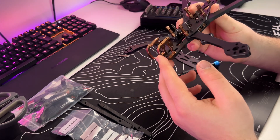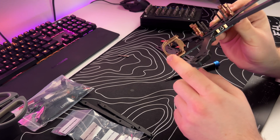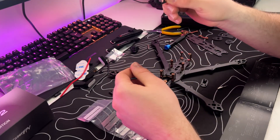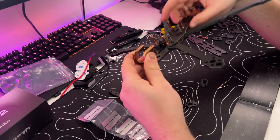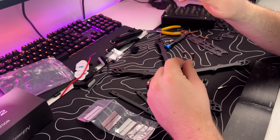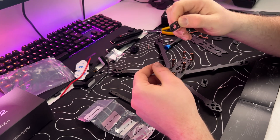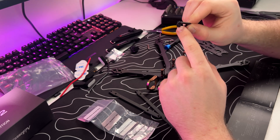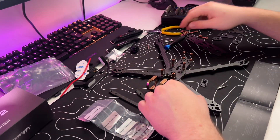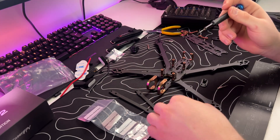Now we attach the metal hardware. Watch out for your two screws right here — they are not exactly in the middle, so they will be a little bit on the top. Watch out when you screw your camera mount on top. Now we can start attaching the camera plate — put them through these two holes on the front. You have two options: a smaller space for a smaller camera, or if you have an O3 air unit you can use the bigger camera mount. First, put these rubber dampeners through the holes, then use two M2 5 millimeter screws to attach them on your quad.